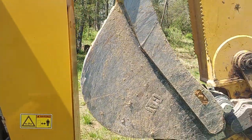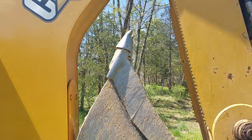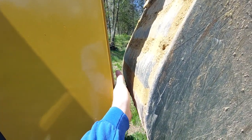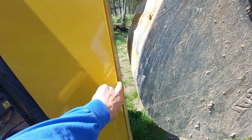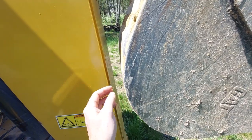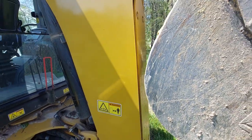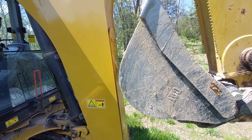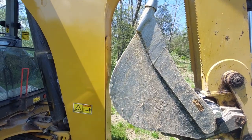Moving to the boom: what I like about the cylinder is that it comes out the bottom, which keeps dirt from getting in as bad — that's a good design. It's got the typical CAT arch boom. One thing to notice is there's very little space between the bucket and the boom. If I have my 36-inch bucket on, it actually hits here — I can't bring the stick all the way in without it hitting this plate. If you open your bucket before running the stick out, the teeth scrape against this metal plate, and it's worse with the 36-inch bucket. That didn't happen with my Case or my 2006 CAT. I wish there was a block or spacer to prevent that, but that's just how the CAT boom folds up tighter than other backhoes.